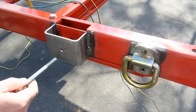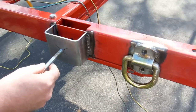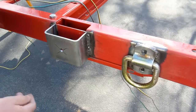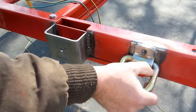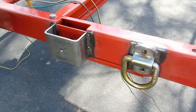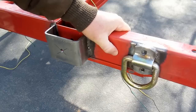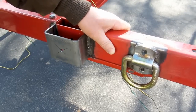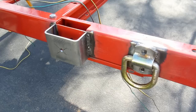These stake pockets had no hole in them, and I don't have a drill press — my last Chinese drill press smoked — so I just put them in a vise and drilled a 3/8-inch hole using two straight lines to find the center. The other modification I'm doing is putting these D-rings on. These are pretty heavy-duty, especially for this trailer — it says 11,000 pounds. I also elected to weld these on, once again because I wanted some practice welding. The other thing is, when you start putting extra holes in load-bearing frame members like this, you're going to reduce the strength of that member, so I really didn't want to do that.